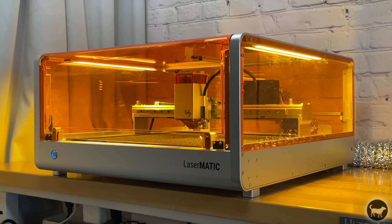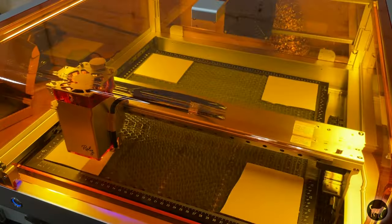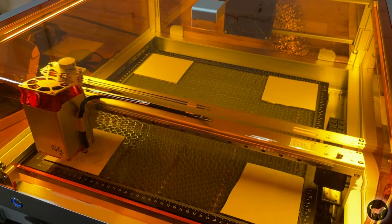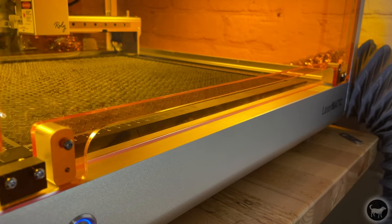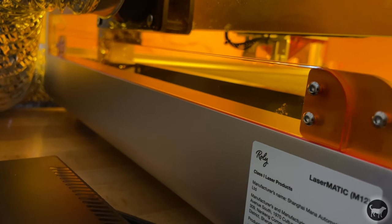The Lasermatic MK2 machine comes fully enclosed with laser safety acrylic panels on all sides for a great view of the machine in operation. These newer panels on this machine also offer an upgrade feature over the last version, and this is a new space for laser pass-throughs. You can see them here in the front and back of the machine. By simply removing the cutout slots, you could slide material roughly 400 millimeters by 30 millimeters tall, or 16 inches by about an inch and a quarter. It's not huge, but does allow you the opportunity to engrave on those longer pieces if needed.